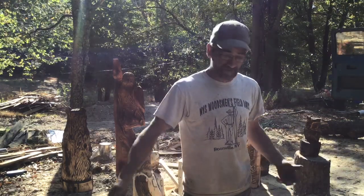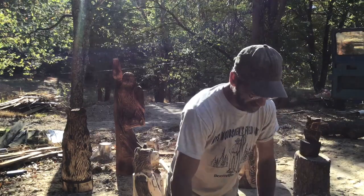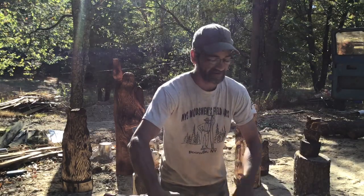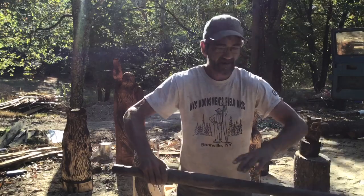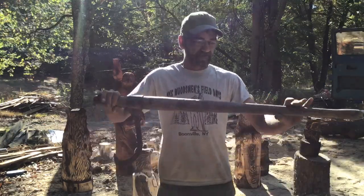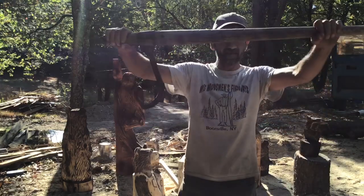Take a 2x4 and screw it to the log, right across the top of the log, while it's laying down. Screw it to the log with a couple of good deck screws. Have a guy get on one side and you on the other, and then you both just lift that thing up. The 2x4 is going to prevent that log from twisting because you're lifting evenly.